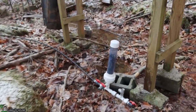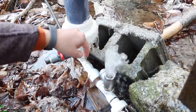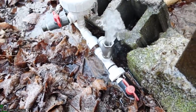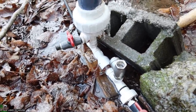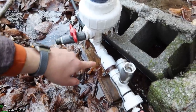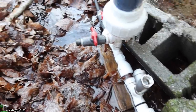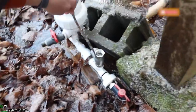Let's see if we can figure anything out. Looks like it's frozen with the valve open. The drive pipe itself seems to be fine, but if it's not been pushing water, something else has most likely busted. There is no water in this tank, which means the inline valve has probably broken and that has pushed water back this way. So if we can't get the valve to cycle on its own, that is likely what's happened. Let's push this a few times.